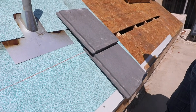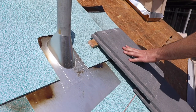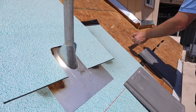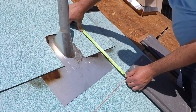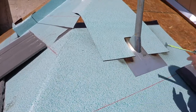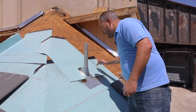So we've got 13 and a half marked out. The same way, what I'm going to do is lift up this tile, put the batten where it's supposed to be, and make a mark. I'm not going to do this on both sides because I've already got my measurement in place — all I'm going to do is measure from this chalk line to this mark right here, and I've got a 13 and a half inch mark. I'm going to do the same thing on this side. Now if you have a pipe, penetration, or vent, what you want to do is mark it on both sides, then we'll discuss how we're going to cut this piece short and continue.